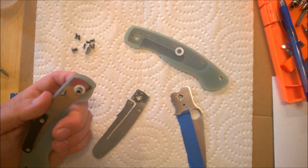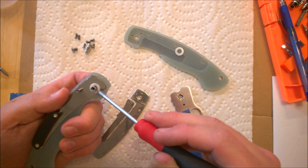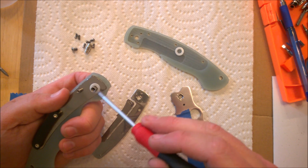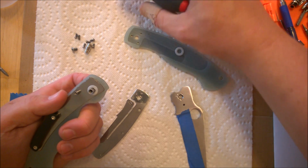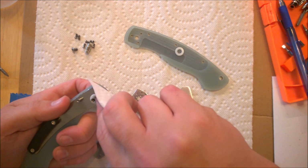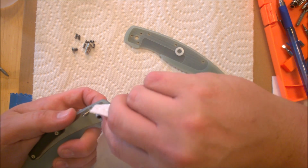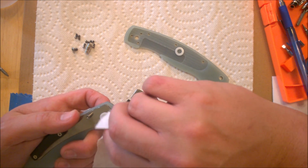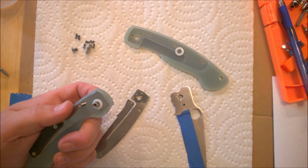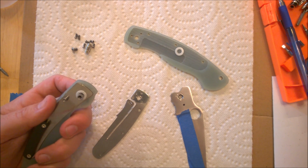The very next thing that I do is important. I take the tip of a screwdriver and I turn that washer around. I spin it on that oil. And I notice there's just a little bit of dirt there. And I can wipe that off now because this side of the washer is still dry. And any oil that I wipe off is extra oil anyway, so it doesn't matter if I wipe off some oil. Okay, so got the dust off of there. And keep my finger on that thing so the pivot doesn't come out.